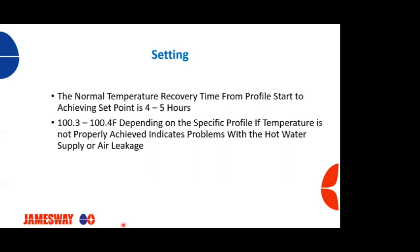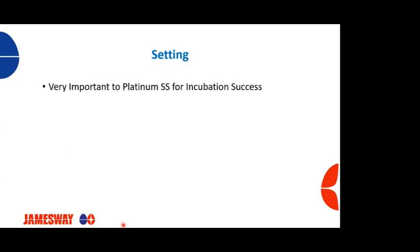Check your temperatures, check your flows, look for air leakage. Are your dampers closed? Are your door seals messed up? Take a look at those types of things. I've shown you and told you what to look for. Now you can start applying some of those into a given situation if you don't get up to a certain temperature.